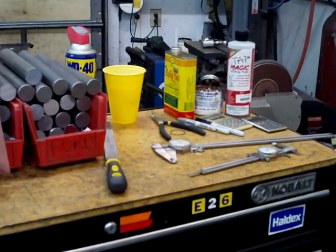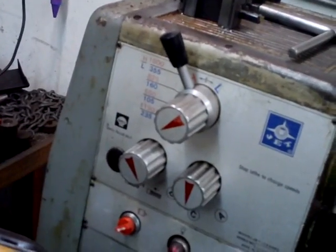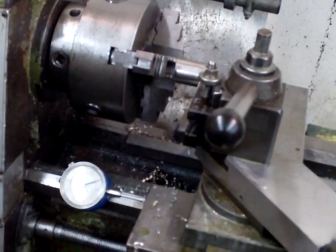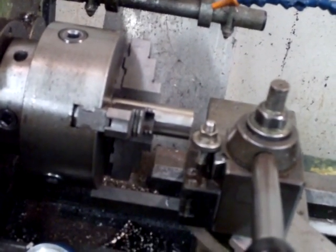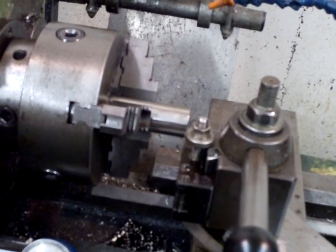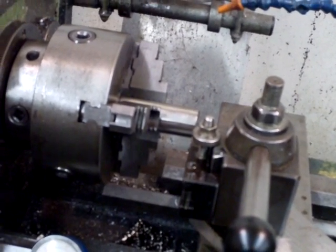There's the Bud Light. The only tools we've got here is one file, a couple of measuring tools, and two cutting tools on the lathe. Right now the lathe is set on 1190 RPM, and the feed is about a thousandth and a half. That right there is the dial indicator, which we're going to use to set up. What we have in the chuck is raw material, saw-cut on this end — the other end is already done. The cutting tool is already in there, everything clamped down, ready to make a cut. I'm going to set this camera on a tripod, zoom in, and let you watch me carve a helicopter blade. Let's see how it goes.